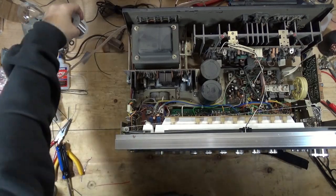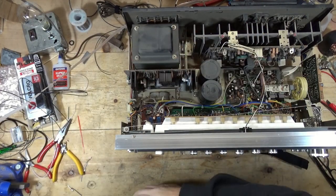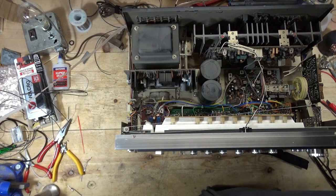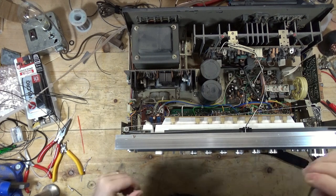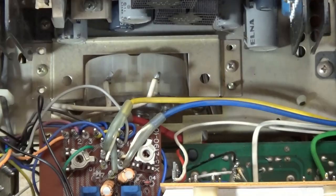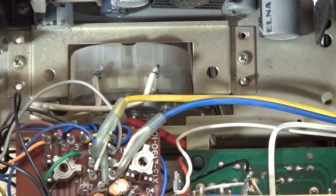This is a receiver that I'm still working on, so ignore the dirty inside of the cabinet and the mess on my bench. If you're watching these electronics repair videos, we all have the same messy bench - too many things, not enough space. I'm going to zoom in on the timer. There's the part we're talking about. You get this and either the timer won't go back to the reset position, or the timer is just spinning because one of the couplers is broken.